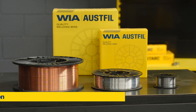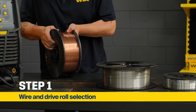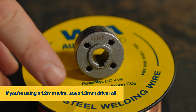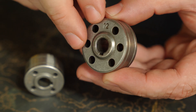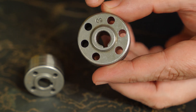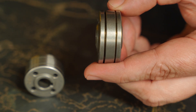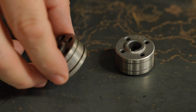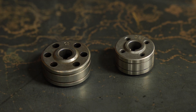Whether you're welding steel, stainless steel or aluminium, make sure you select the right wire and drive roll type and size for your application. Both the wire diameter size and drive roll groove size should match. The Weldomatic 200 Plus and 250 drive rolls have two groove sizes. The size is labeled on the opposite side of the relevant groove size. If you have both the Weldomatic 200 Plus and 250, it's worth noting they each take different drive rolls because the drive roll sizes are physically different.